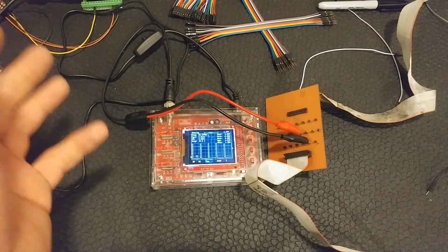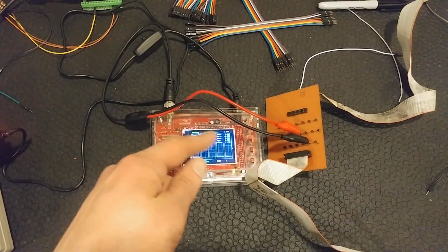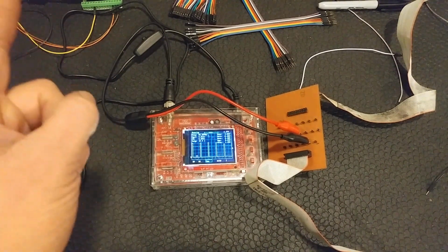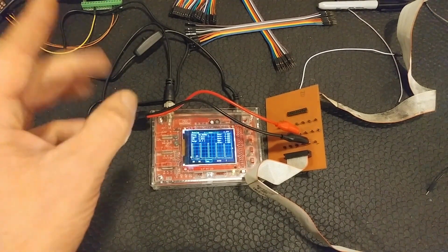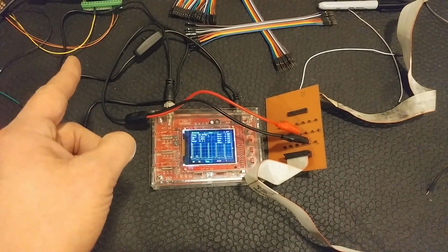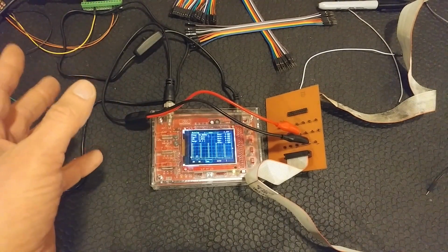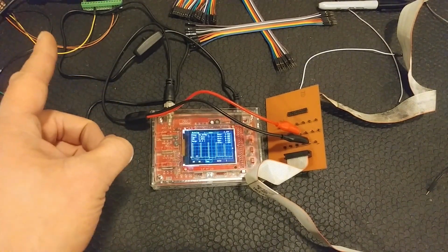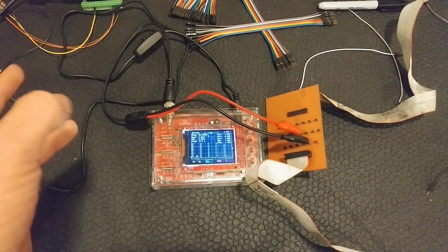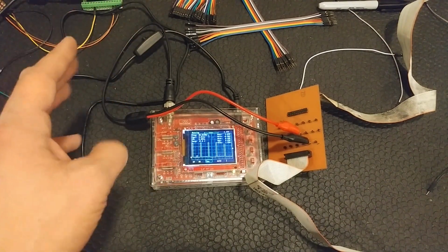Now, in my testing with the Arduino, I found the VFD doesn't really care what your frequency is, luckily, because the analogWrite function on Arduino by default operates at around 490 hertz for the Arduino Nano I have here. A few others have different frequencies, but it's in the ballpark of a couple hundred hertz. So I can still use that without having to resort to manually programming out the square wave function. I can just use analogWrite, and it makes it straightforward, simple.